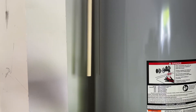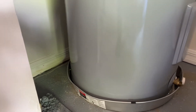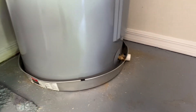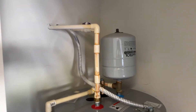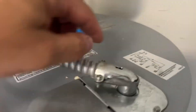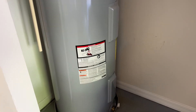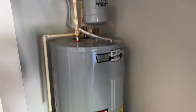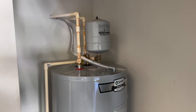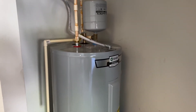The other problem is that the TPR discharge tube comes down and terminates outside the pan, and it also terminates way too high. If you know how far down it has to be at a minimum, that's in the International Plumbing Code — comment below. Unable to tell if the ground is connected or not, as this particular brand does not have the piece where you can see the ground wire going through. Two major violations for the installation of this tank water heater — like and subscribe to the Building Code Forum, and start commenting. Maybe there are other violations you see that I don't.